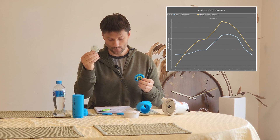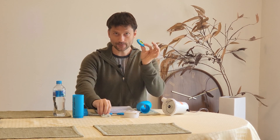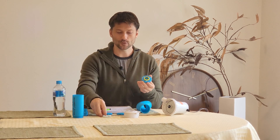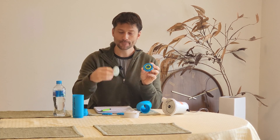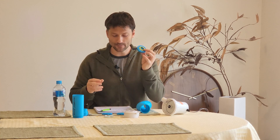Total work done: 28.9 watts up to 40.5 watts — a significant improvement. You're not going to burn out your pump. The only disadvantage I can see to this design is potentially it getting plugged up with pond scum more easily than the open-faced version. You would simply solve that by wrapping some window screen around your bilge pump, which is good practice anyways if you're working in a river with pond scum. So that'll keep this running clean.